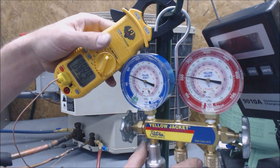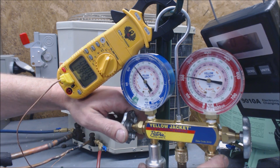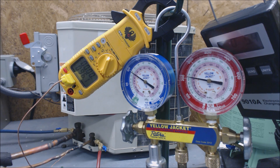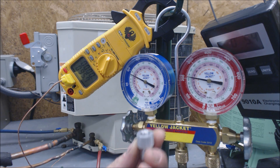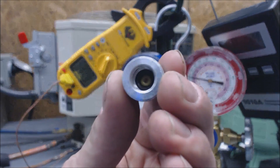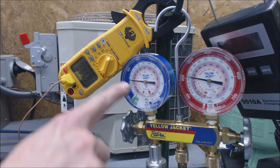Kind of a rig of a setup here just to show you. This smaller liquid vaporizer is not going to work as effectively, but it will work. Anytime you have a little pinhole like that, it's a restriction — it's a metering device — and that helps with flashing the refrigerant.